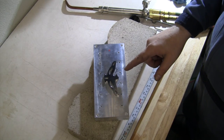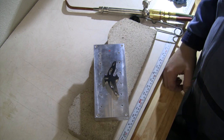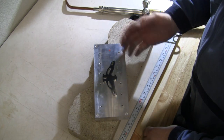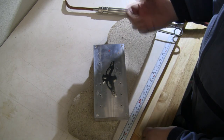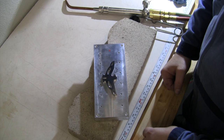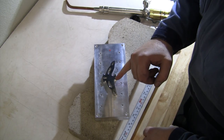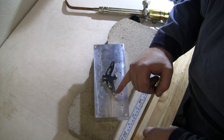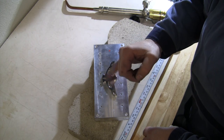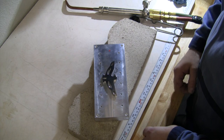All right, now my goal is to get a feather-like blue color on here. Like I say, I've not been flaming titanium much. I've got it on a piece of aluminum to try to keep some heat out of it. I'm going to put on my finest tip on my torch. We're just going to see what happens. Little experiment here. I'm going to start here at the neck, work my way across this one, pretend like I'm on that same line over here, and then just work my way down, and we'll see what happens.